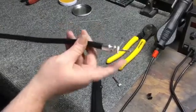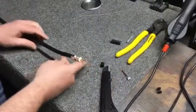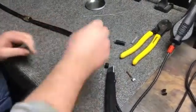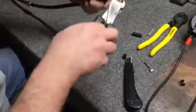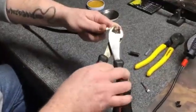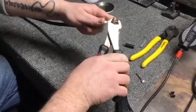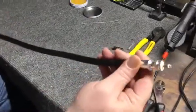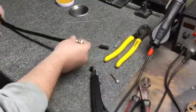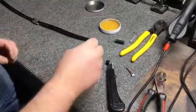You see the shield on every single hole. The center conductor is fine — we're going to snip that. Look at the angle of the connector and snip at that same angle. That's what you want to end up with.